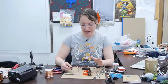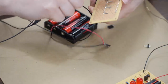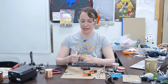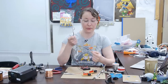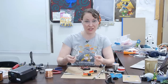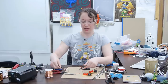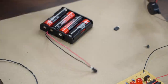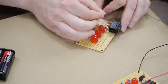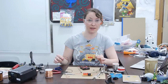Now it's time to add our battery pack. We want the black wire of the battery pack connected to our ground leads here, and the red side is going to be connected to our wand. Now you could solder this directly to your perfboard, but I like to have things modular and changeable, so I'm using header pins for everything. I've attached female header pins to the end of my battery pack and I'm going to add male header pins onto my perfboard for the battery pack.